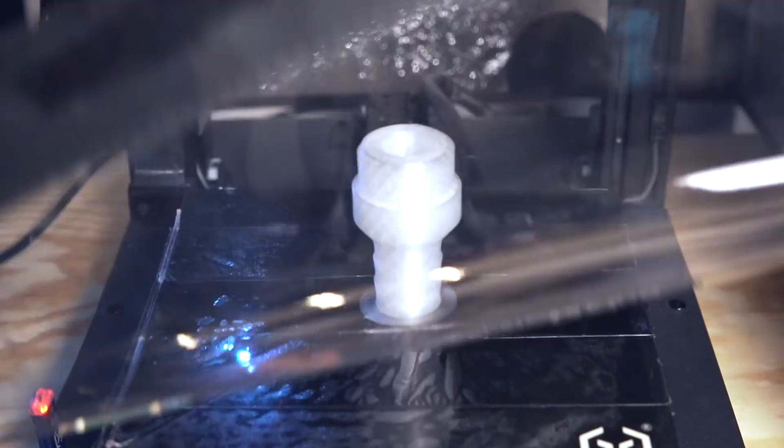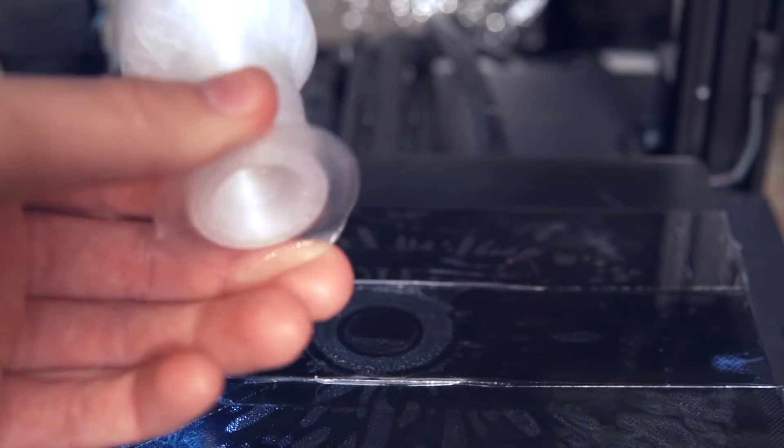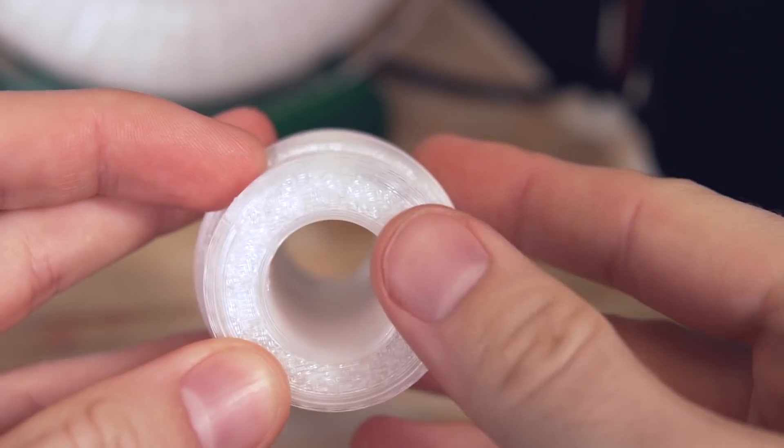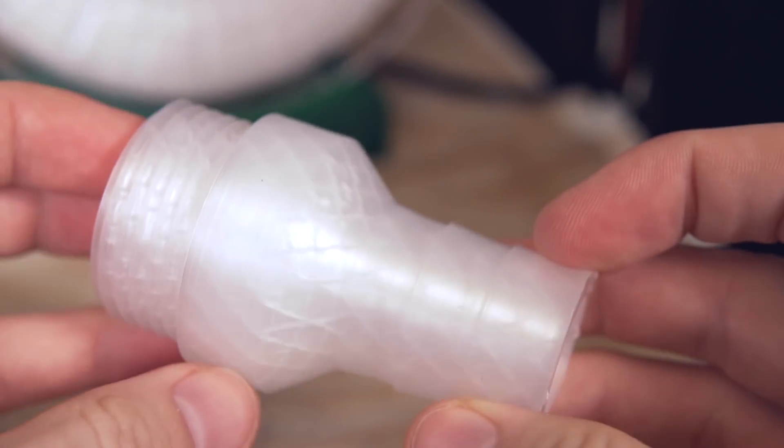For the final model that I printed, I printed just a hose fitting, which basically had some threads on the top. This was about an eight-hour print — and although it's not the biggest print, the reason why it took eight hours is attributed to those 15 millimeters per second first layer and outer wall speeds and 40 millimeters per second overall. I was really, really happy with the way this part turned out. The quality that it came out with was fantastic. The main reason I think it turned out much better than the other models is because the area touching the bed is so much smaller. Polypropylene doesn't have any issue adhering to itself — it's just that first layer. So because it only needed to attach to the bed in such a small area, it wasn't having as much of an effect with warping.